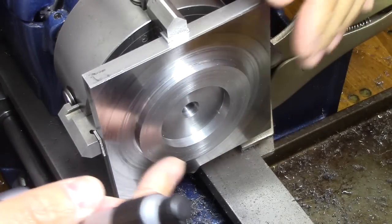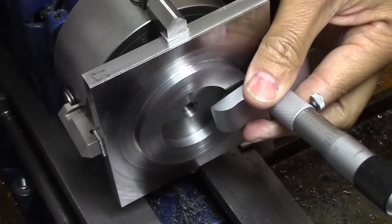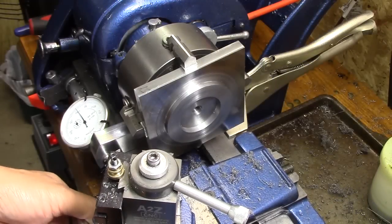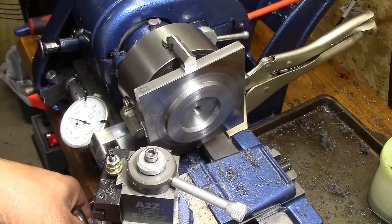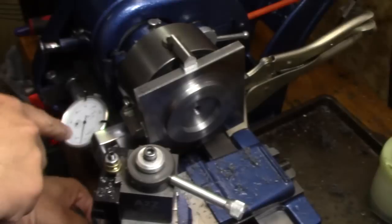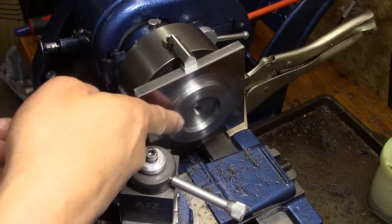Well, the only thing to do on this side is to bring this lip down to 100 thousandths. So we'll measure that out and get her done. Guys, what I've been doing, and it's pretty effective so far for my depths, is I'll zero this out by touching it. And I wanted to go 104, so I dial in the 104 and then put my vise grips over there and then make sure I test it. And actually I dialed in 103, give myself a thousandth.